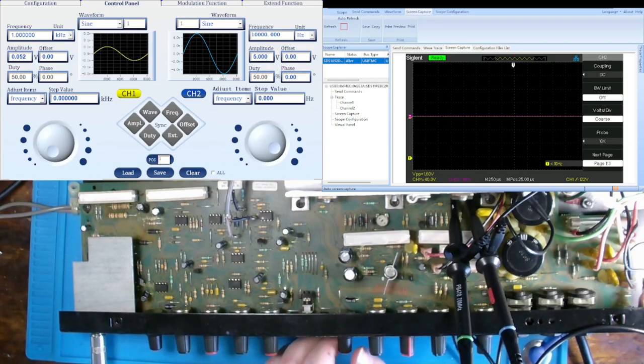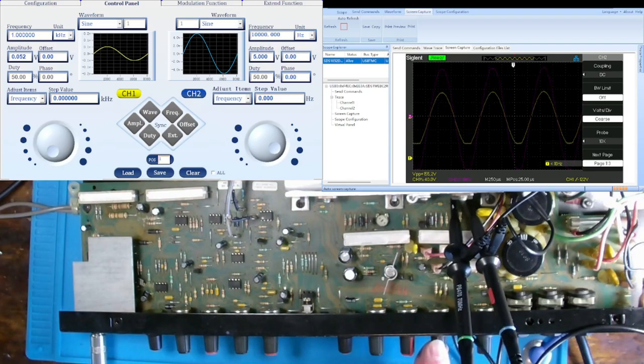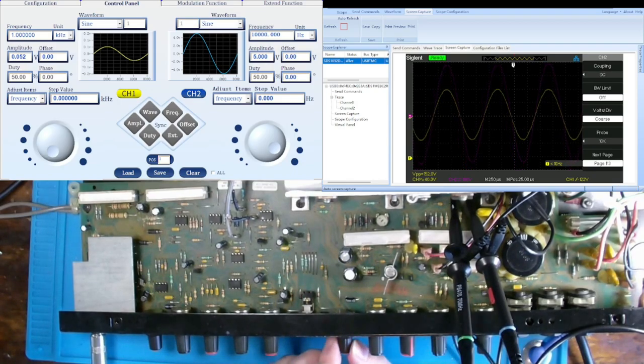And now doing the same thing on Darlington transistor tip 142, probe 1 on the base, probe 2 on the emitter. Again, on the O-scope, the base will show up as a yellow sine wave. The emitter is probe 2 as purple. And as I increase, you'll see the amplification. Turn that potentiometer pretty quickly. But yeah, it's there. Looks good. Not overly distorted. I would say that transistor is working as it should work as well. So good power transistors.